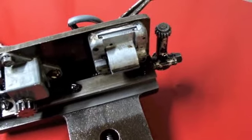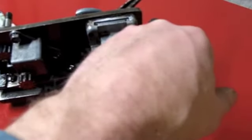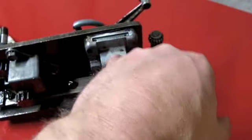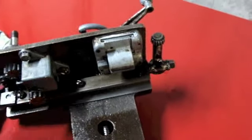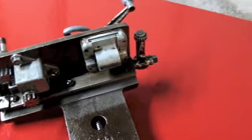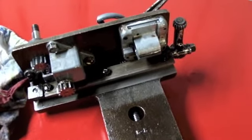for feed. Now, you've only got this one lead screw going through here, and the same half nut is used for the thread feed or for feed when you're turning. And there's no cross feed on this lathe. Now, I'll show you on the Hendy what a better lathe will have.